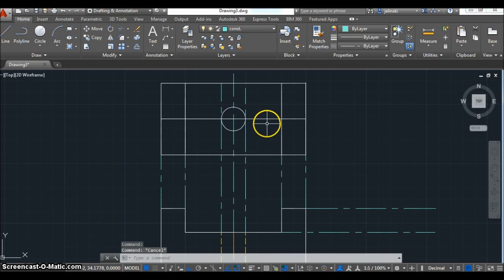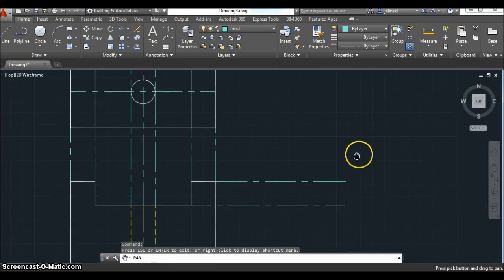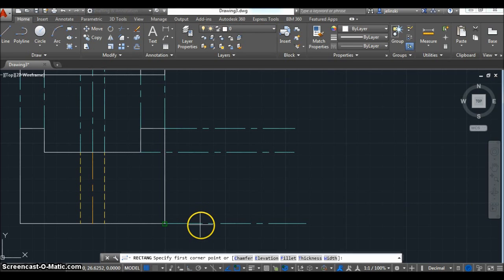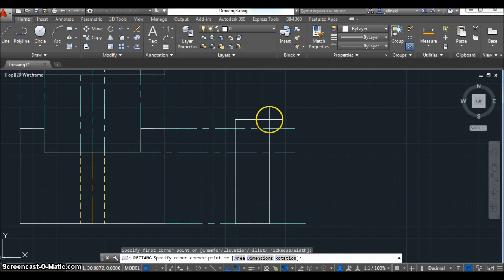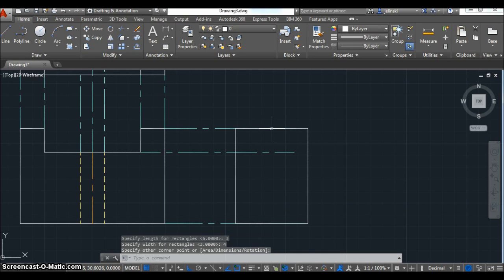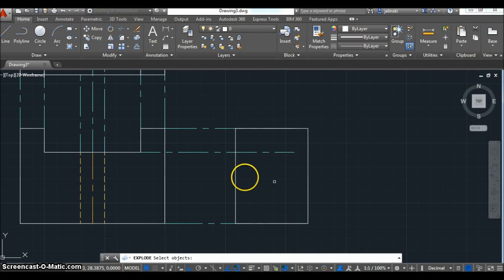I have most of the top view done. I'll take a look and clean up what's needed — turn that back into a construction line so I know to delete it. The line colors are close together, so consider picking more distinct colors if you think you'll lose track. Now I'm going to create another rectangle for the right side view. Object snap helps me grab a point on that plane to start from. Using my already established dimensions, I can create this rectangle easily, knowing the horizontal construction lines confirm it's lined up perfectly. I'll explode this right side view rectangle to offset and line up the hole.